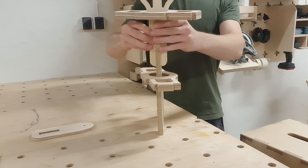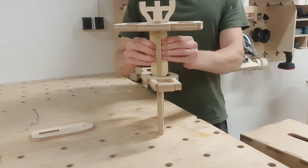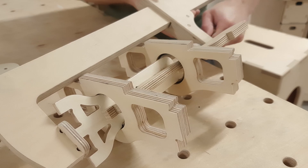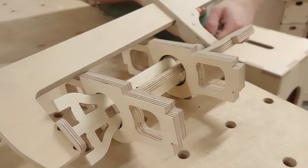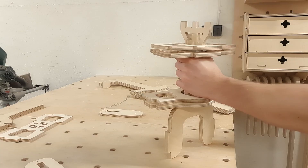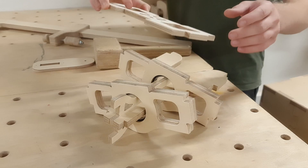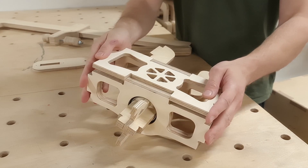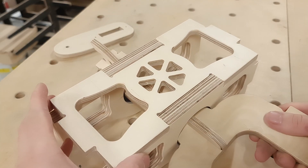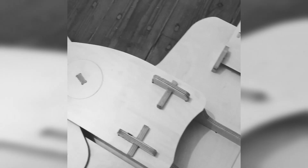Before attaching them to the parts, I had to make a few corrections with a chisel to ensure a precise and tight fit. When that was done, I could slide one of the bearing assemblies onto the fork component and the other one onto the steering wheel axis. Then I could join the axis parts together. Since the half-lap joint we used for the steering axis is quite long and cut without any tolerances, the assembling required using clamps. But in this case, the tight joint is good. After the steering axis is assembled, I can add the front cover component, which concludes the main part of the steering mechanism. It's a very simple solution, but getting to it wasn't easy.